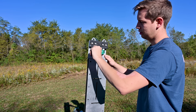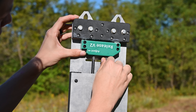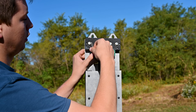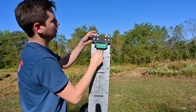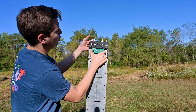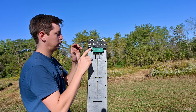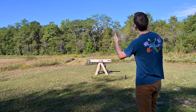All I gotta do is loosen these bolts and slide this up, then tighten it down. The back will take longer to release — that's what the back releasing slightly after the front does. You can see the first one is already released, this one's not. As you slide it down, boom, this one releases. That's what actually counteracts the spinning. We should be good now and hopefully get a similar speed with a straight-up launch.